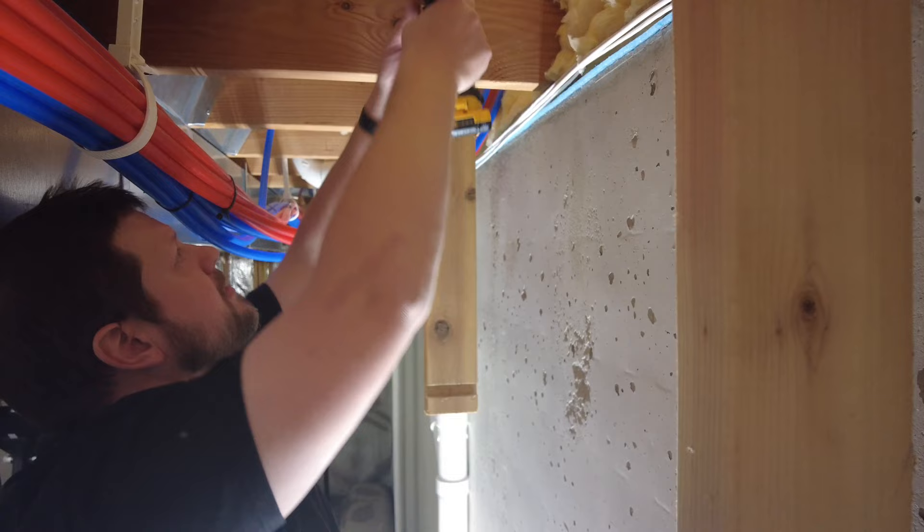Once you have that figured out, the next big piece is determining where to mount or install the water filtration system. You might still want to install it underneath the sink, especially if the sink is close to the refrigerator. In my case, I have a basement with an unfinished area underneath the refrigerator, so I decided to build a shelf to hold the reverse osmosis filters and the extra tank, getting everything as close to the refrigerator as possible while still being accessible. Alternatively, you might be able to install it behind the refrigerator or in a nearby cabinet.